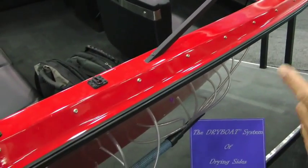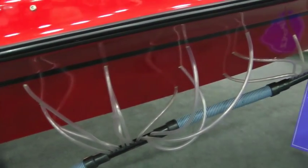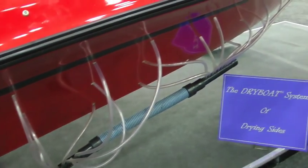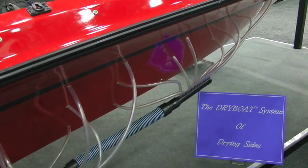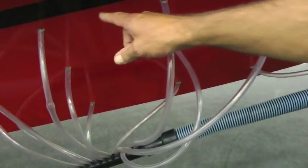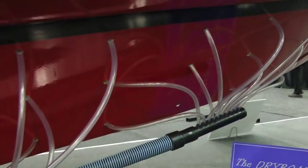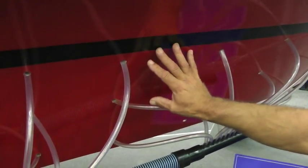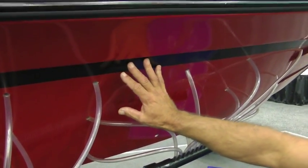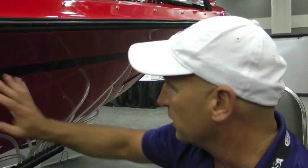What we do here at dry boat is the same repair. As you can see, we inject desert dry air into the boat and dry that core area. We can pinpoint the area where it's wet and we drill into those areas. Right here, you can see the minimal amount of damage we need to do. We can even eliminate this completely if we're able to get at the backside of the hull side, and then we wouldn't even have to go into the gel coat.